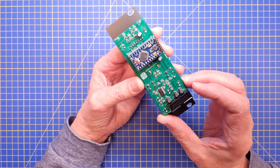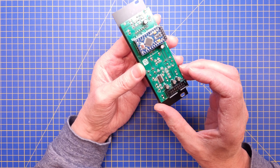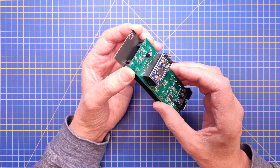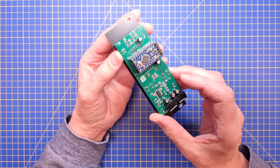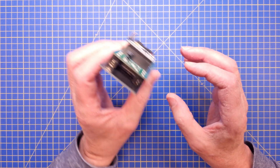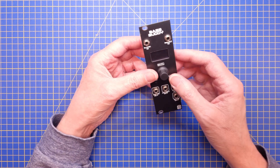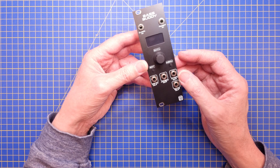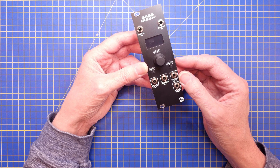But it turned out that it was actually quite a bad idea, because the digital-to-analog converter that I use in this design doesn't have an internal voltage reference. Without going into too much detail, what that basically means is that if you move this module around between cases where the 5 volt is changing a little bit, the one-volt-per-octave calibration will not work — it will sort of go out of tune.